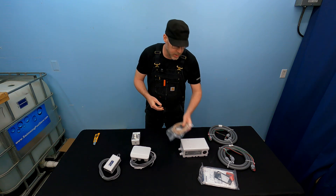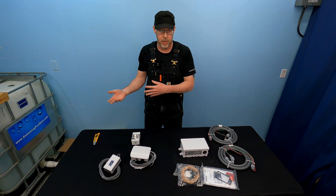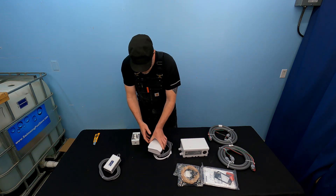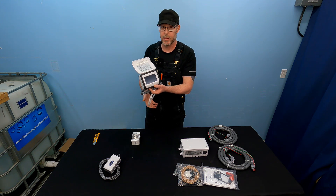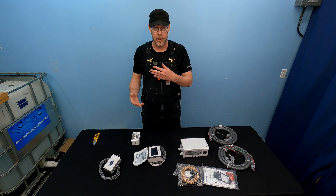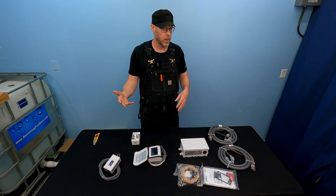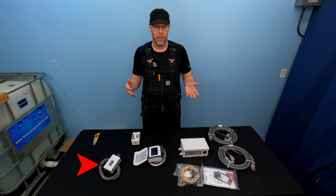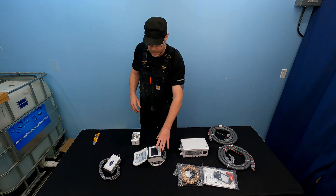These are probably your temperature sensors — that would be for your heater. How are you going to interact with your heater if you don't know what the temperatures are? The system reads the temperatures so you can make adjustments and turn the heat up and down. And then finally, we have the control panel, which is your interface. You have the ability to interact with your pool equipment — your lights, pump, heater, and salt chlorinator. With a daughter expansion board module, you can include salt chlorinator control. There is one relay included for controlling the on and off of a line-voltage 115-volt peripheral item, and that's what comes included with the kit.